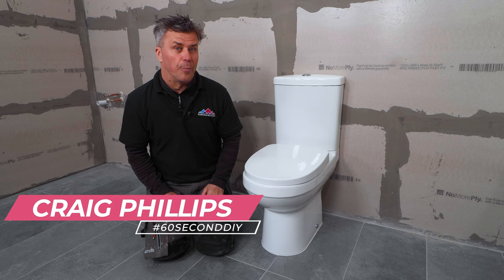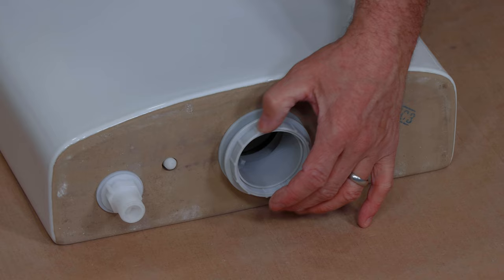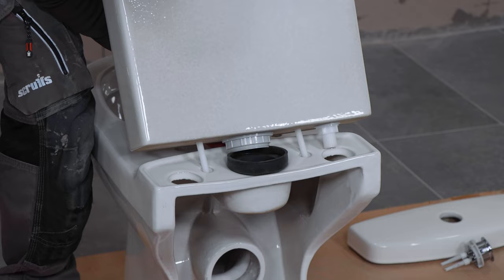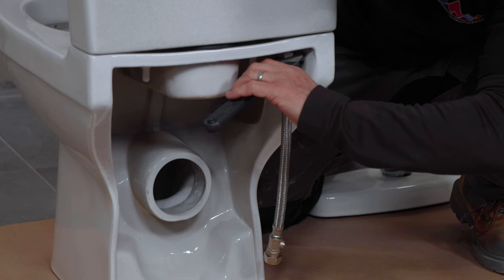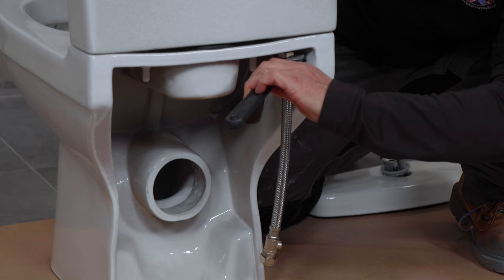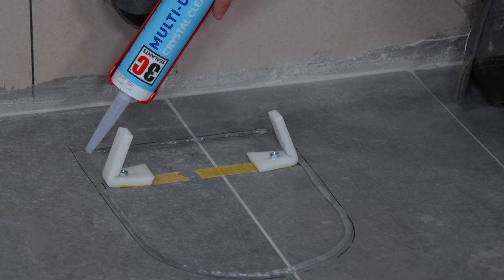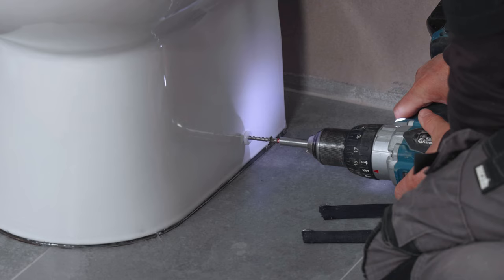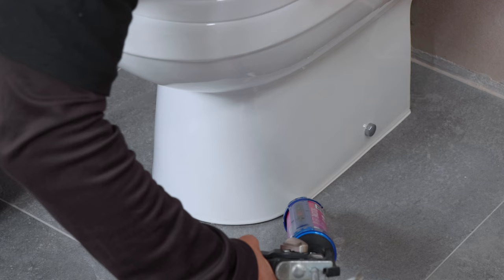I'm going to show you how to fit and plumb an entire toilet system. Start by installing all the components — slide the two bolts into position, fit the rubbers onto the filling and flush valve and place them in. Tighten the bolts up at the bottom by hand. Sit the cistern system on top of the rubber washer, sliding the two bolts into position. Apply the wing nuts below and tighten by hand. Attach the flexible hose to the fill inlet and tighten with a spanner. Place the pan connector over the back of the pan and mark up on the floor tiles where the pan is going to sit. Drill your holes and fix your brackets in position, then run a line of clear multi-use adhesive around the base. Sit this on a couple of packs to start with. Connect the flexi hose to your 15mm mains and tighten with your spanners. Drive the screws through the toilet into the brackets, remove the packs and run a clear line of silicone around the base. Install your toilet seat and then apply a line of white silicone.